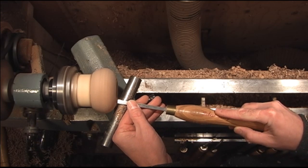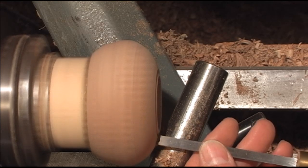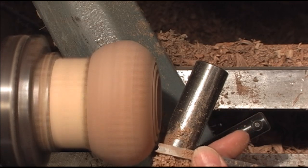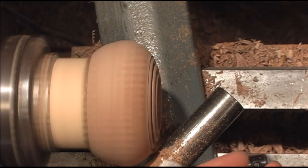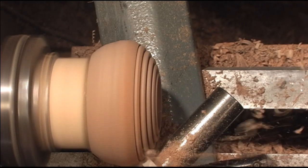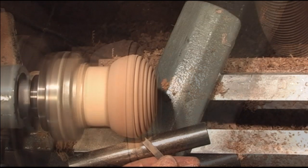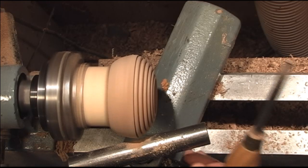Just take the tool and push it straight in, just like a scraper. Put the side of the hook right in the other hole and just push it straight in, right until it starts to scrape against the back, and that way it rounds the whole piece over. Just work your way around. Come around the side, roll the tool around a little bit and it will round the whole bead over. Just keep working your way around the side.